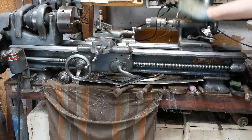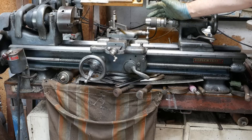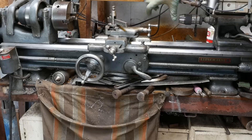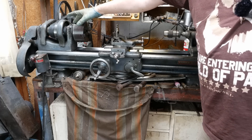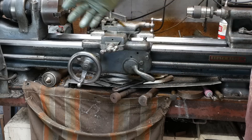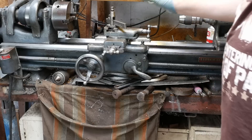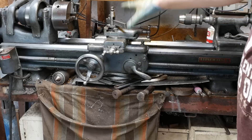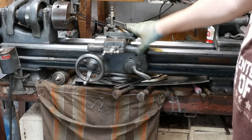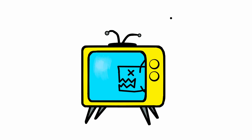You can see why South Bends are still a very sought-after lathe even today. It's just a nice size, fits in the garage nicely, it's got a good size swing for all your home shop stuff, the bed's nice and rigid, it's got a good distance between centres. With three speeds plus the back gear you've got a wide range of cutting speeds, it can cut threads - it may take a little bit of time to set up the change wheels but it can get everything done. It's a lovely lathe, and since there's only one tradesman in the next generation of my extended family, I'm pretty sure Henry's going to love it when he eventually inherits it - which hopefully is a long time in the future. Thanks a lot for watching.